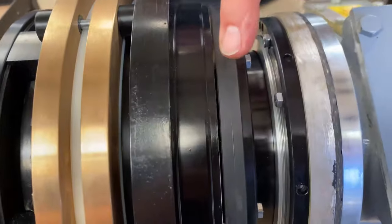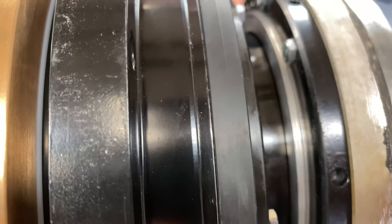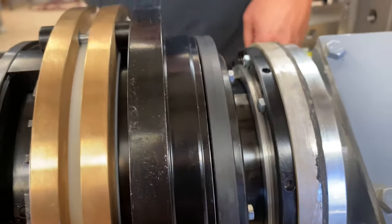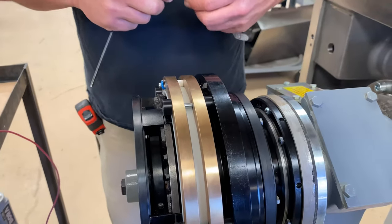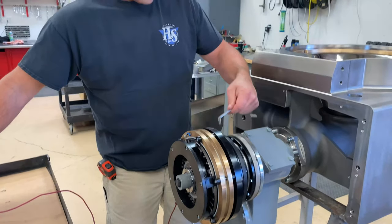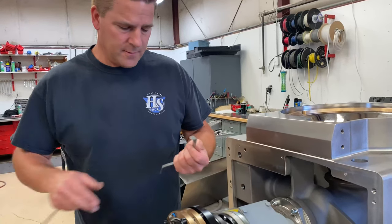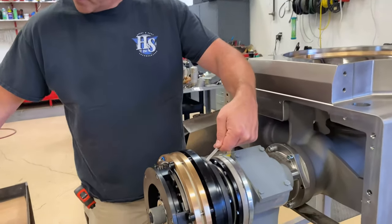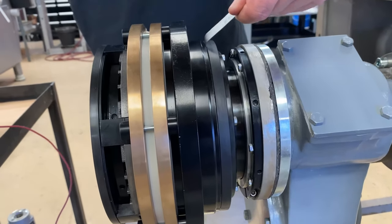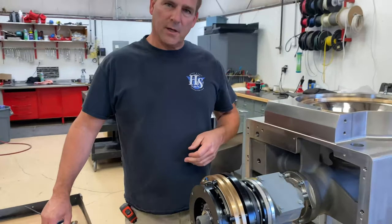So when I power it up, if you look in on this armature gap, you'll see it reduce — it pulls in, out, in, out. So at the end of this adjustment, the 1.2 millimeter feeler gauge should go in here with the clutch de-energized. The 0.8 millimeter — you want to be able to pull it out and it should move a little bit like that. That's adjusted properly. That's how you adjust the main clutch.